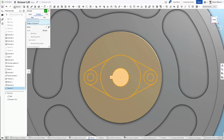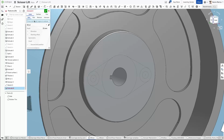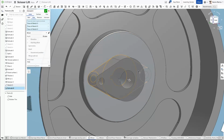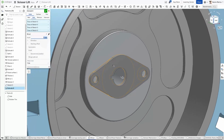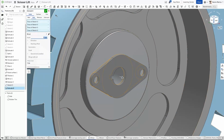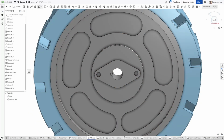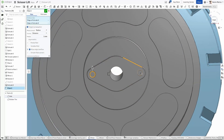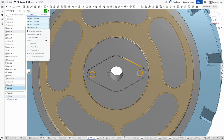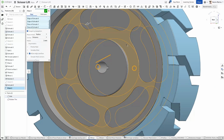From here, I can create a quick extrude, and I'm just going to be extrude adding as a solid these faces that we've created, except the circles. Now I'm going to make this 5 millimeters. It does not need to be huge. It's just going to add that component to our shaft. Now, as a last set of steps, I can add some fillets across this geometry here, as well as the interior geometry. And then you can also add some fillets to this interior geometry here. Do remember that you have a backside that you might want to do the same thing with.